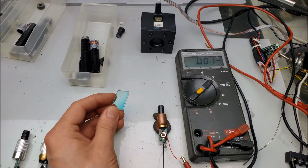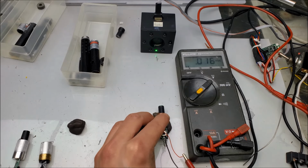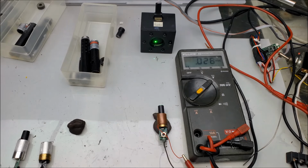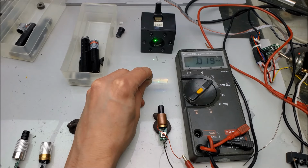So turning on the power supply, and I'll be connecting the laser module up. So it starts off at about 30 milliwatts, goes down, center that a little bit better here. We'll let that settle. So it looks about 25 milliwatts. Only 5 times over the FDA limit. That's nice. We'll put this in front to see how much of that is infrared. So about 6 milliwatts of infrared.